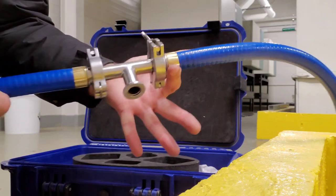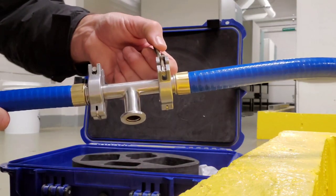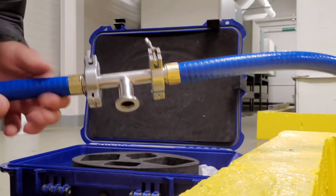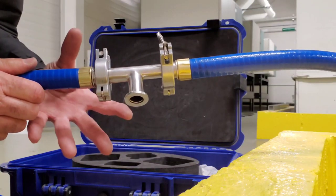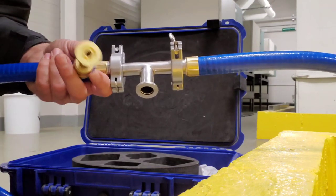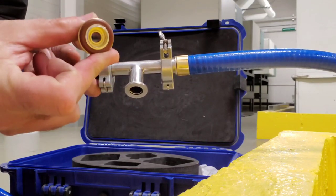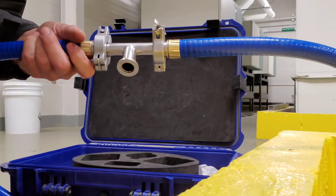I have some of this assembly put together. We have a stainless steel T and some clamps. These just go on hand-tight — nothing past that. We don't want to over-tighten these. Now, as you start to pull a vacuum, these things actually seal up much better as you pull a vacuum. To make sure we're doing this correctly, each fitting needs to have a seal there, then it just goes on, and then we apply the clamp.